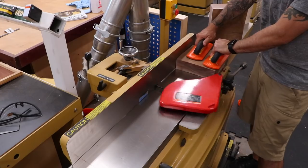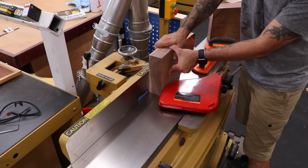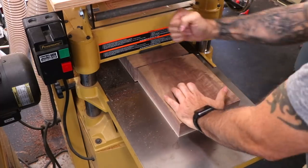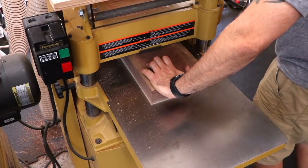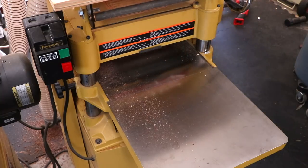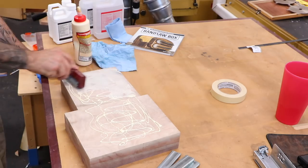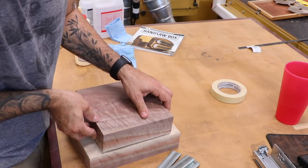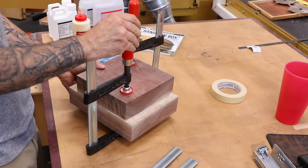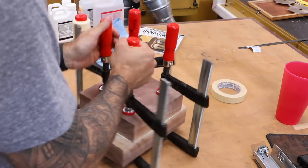Let's get to the build. I'm lucky to have some 12-quarter walnut on hand for this. I'll mill up two pieces so I can glue them together for a nice deep box. You can also stack up numerous layers of thinner material for some cool effects. In my case, both pieces have a decent amount of sapwood on one face, so I'll glue those faces together to give the illusion of grain continuity. My pieces aren't exactly the same size, but it doesn't matter — this is just a rough blank.